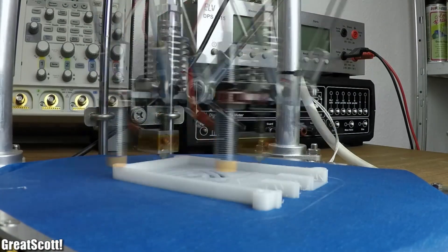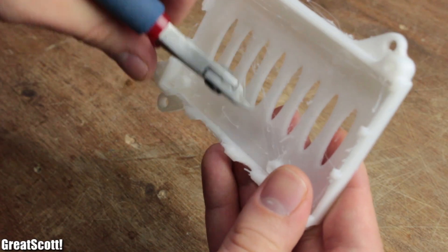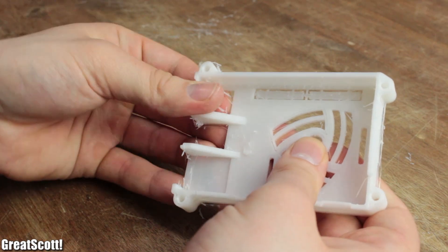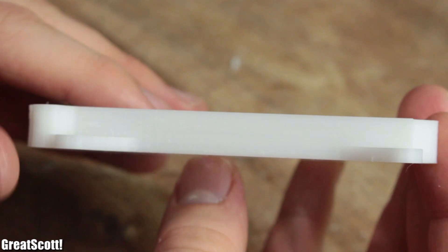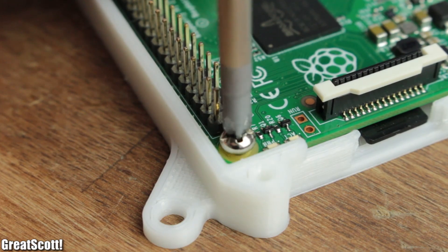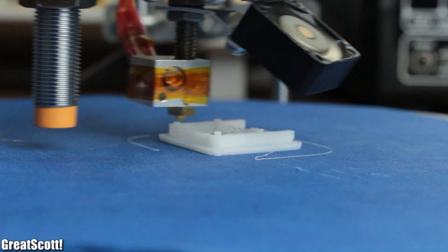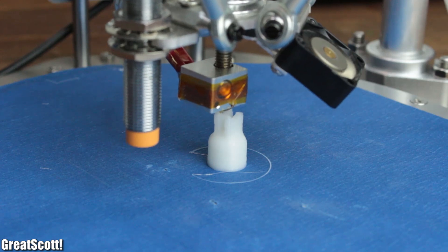Since both models had a pretty simple shape with no overhangs whatsoever, the machine had no problems during the printing process. But I still had to remove quite a lot of excess plastic strings afterwards, which were created while the extruder moved from one side to another through mid-air. Nevertheless, both prints looked quite neat, so I used small wood screws to secure the board to the bottom side and M3 bolts to join both sides together. Afterwards I printed the back and front side of the camera mount as well as the masthead.